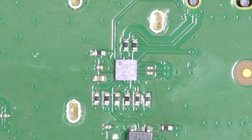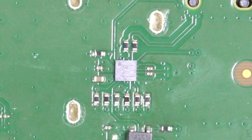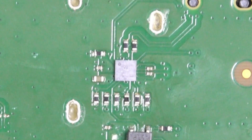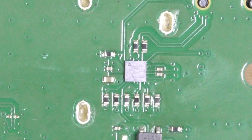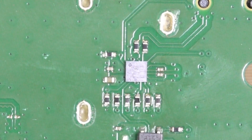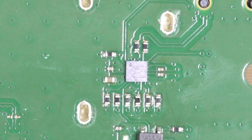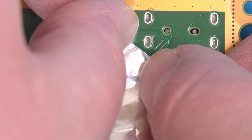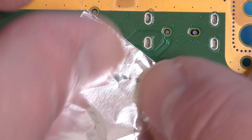The first thing I like to do is get the board taped up and protected. We're going to be chucking some serious heat into this thing and there are some very sensitive components close by which we really don't want to disturb. I'm thinking mainly of the ESD booster IC. This chip is, at best, very difficult and expensive to get a hold of. There are some fixed boards available for replacement of a faulty IC, which are brilliant by the way, but we don't want to be damaging, knocking or cooking this IC if we can at all avoid it. Get that roll of heatproof tape out and cut a couple of lengths to cover the booster IC region.